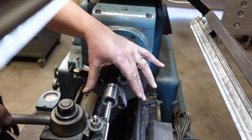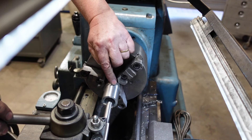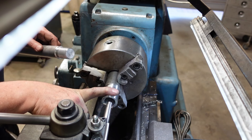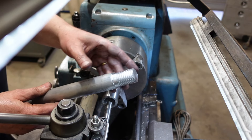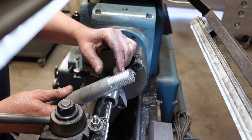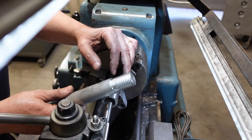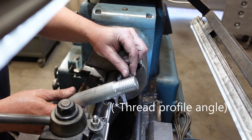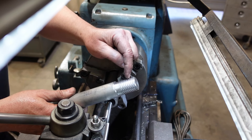I'm now making up the nut to go inside the wheel. I've bored the wheel out and this is a nice neat fit. When I finish this I'll part it off and TIG braze it onto the cast iron - fingers crossed that'll work. This being a UNC thread, I've had to make up another dummy thread piece, so I've now got a UNC, a Whitworth, and a metric all around about that size. This fits the spoke handle quite nicely, which gives me confidence the nut on there is UNC - if it was Whitworth it wouldn't go on, because the difference between Whitworth and UN thread is the pitch angle, meaning the peaks would interfere with the root.